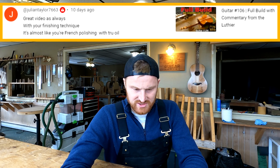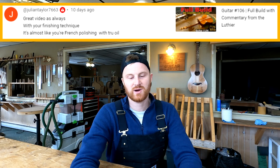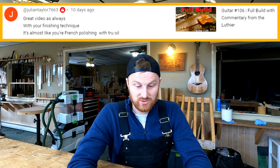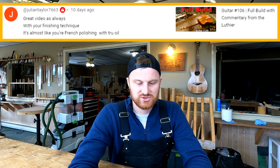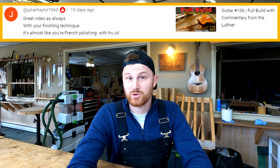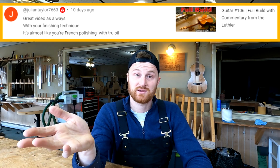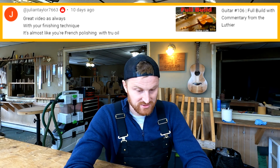Great video as always. This is from Julian Taylor. Great video as always with your finishing technique. It's almost like you're French polishing with True Oil. Yeah, that's basically what I'm doing. I'm essentially French polishing with True Oil, with some differences there. French polish is traditionally a shellac, a method of hand rubbing shellac. But I borrow a lot from the French polishing world to do my True Oil finishes. By the way, I have a course for you guys who don't know on True Oil finishing on my website, ericschaeferguitars.com. But yes, it is very much like French polish.